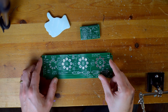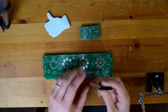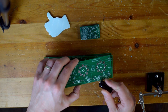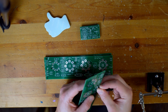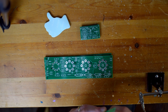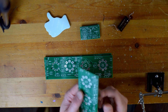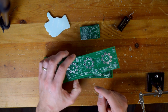The second thing — I'm going to test this right now. I'm a little concerned that the leads on my filter capacitors are not going to fit in these holes, which could be a tremendous problem. It fits, but just barely — it's a tight squeeze. So in the future I'll need to reconsider how I do these filter cap leads.